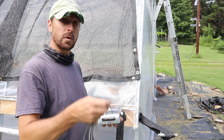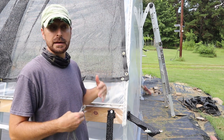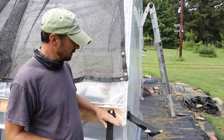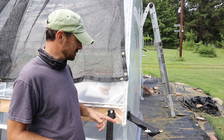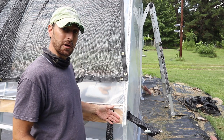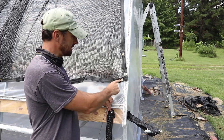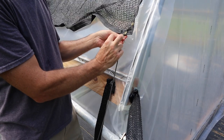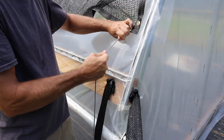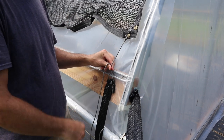Now it's time to secure our shade cloth. We've got some paracord and some screws and washers. Our shade cloth doesn't come all the way to our hip board — that's just the length we wanted it. So we're going to tie it to the grommet and then tie it to somewhere else. We can use those screws and washers, but I'm going to attach it to this strapping that guides our roll-up side. I'm going to come underneath, tie it and secure it to here, then tie it to the grommet. Done. Easy. You can use whatever knot you want, whatever secures it best for you. I'm just going to put a series of half hitches and that'll be all set.